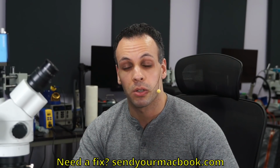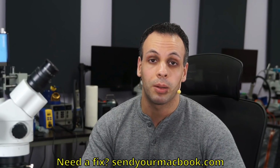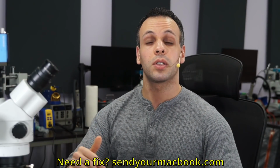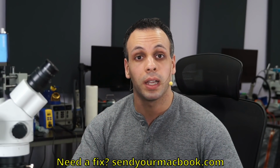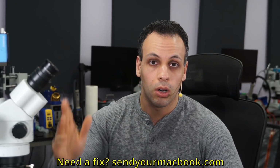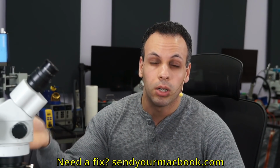Okay, what power all turns it on? Let's find that. Okay, why is that rail not present? Is it shorted? Is it not being enabled? Is it missing its input? This is all stuff that's in my free board repair guide, which you could find in the description down below. 150-page guide to motherboard repair, going over all the basics and the troubleshooting tactics. We go up the chain.